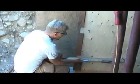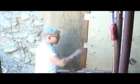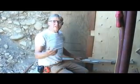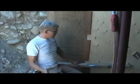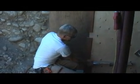Now that is going to create a nice straight wall. Other people will frame the wall up vertically as well. You can, it depends on the wall section. In this case, I'm replacing the corner of the basement here. I don't really need that type of reinforcement, so we're going to stick with a flat 2x4 with the reinforcement using the conical ties.